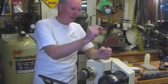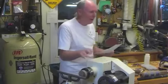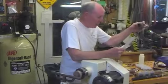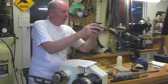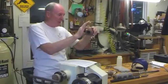So let's just face this off. Okay, you're following this very closely. So where were we? Okay, so far we've done through step number 17, through the hole in the vessel bottom for gluing, right? And then hollow the vessel to the quarter inch wall thickness up to your support column, which I'm considering this part here to be the support column. Or if it were a bigger piece, this would probably be larger.